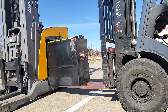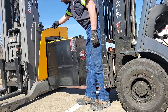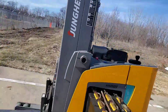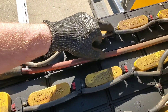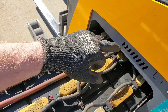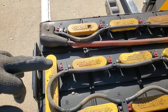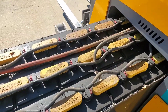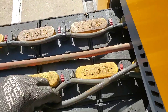Let's see where we're at. So we've got one, two, three, four, five left, six, seven, eight, nine — number nine is this guy right here. Looking at the top of the battery: one, two, three, four, five, six is just underneath there — it crosses over — seven, eight, nine, ten, eleven, twelve, thirteen, fourteen, fifteen, sixteen, seventeen, eighteen. This is our culprit; we already previously diagnosed this.